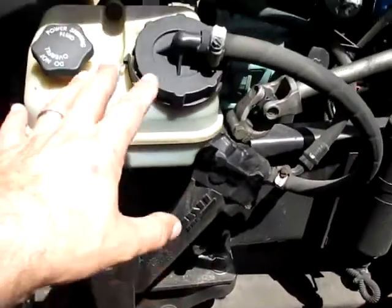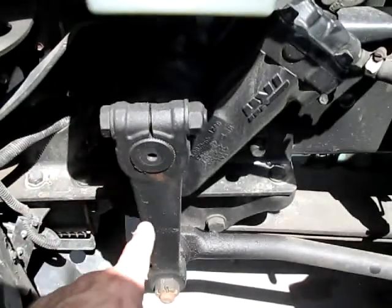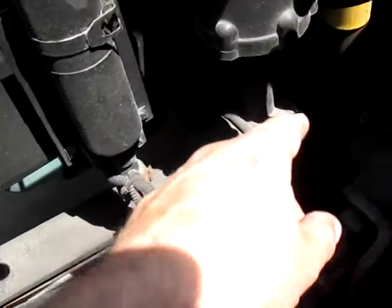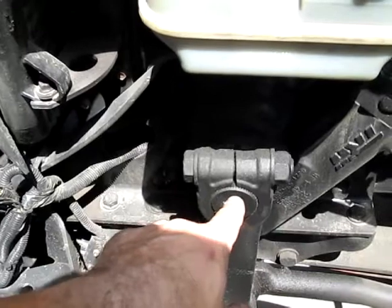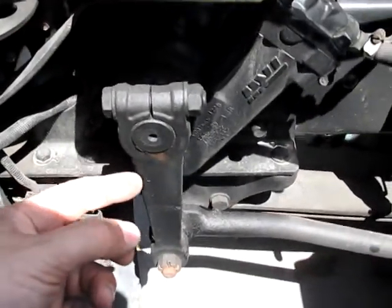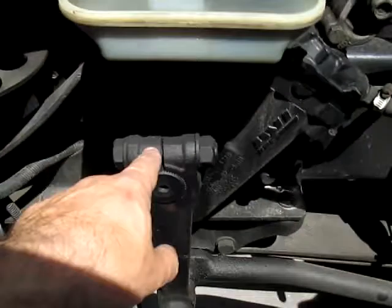This here, where you've got the power steering box, the fluids, and all the accessories connected to the power steering box, you want to make sure that this is tight. A lot of times when you hit a lot of potholes, you have a lot of impact here. This whole thing moves in the front, especially when you've got a lot of weight. Now I'm also inspecting all the connecting rods on the shocks. Looks good. And coming back to the steering compartment, make sure that this is pretty tight. Sometimes you can tell your buddy to get in the truck while the engine is running and turn the wheel left and right, and this way you can inspect your whole control arm in front of you. You can inspect everything that's related to the steering wheel.